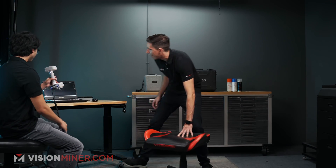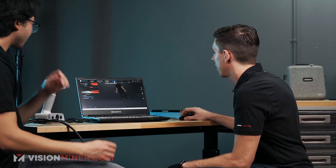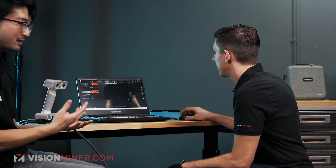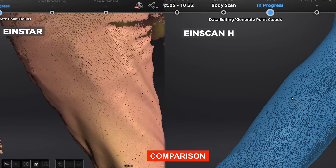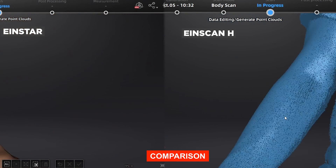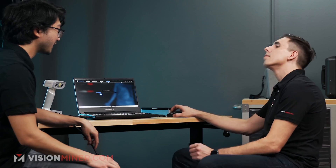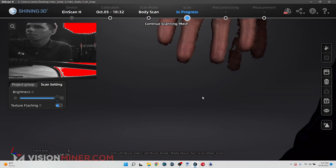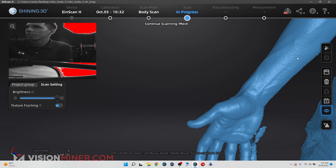Let's check it out. What are the biggest differences between the scan with the EinStar and the H? The EinScan H does have a bigger scan frame so we're able to capture more data, but the scanning process is very similar — we still have to paint in the subjects from a lot of different angles. The biggest thing I noticed is the density of points compared to the EinStar — there are way more points in there, significantly more. Density of points correlates with resolution and surface detail. Looking at the hands we can see wrinkles on fingers and veins on the palm — we wouldn't really capture that with the EinStar, but with the EinScan H we can see all of that.